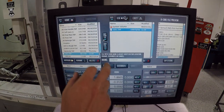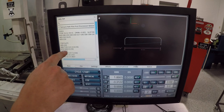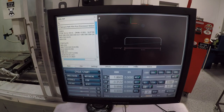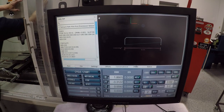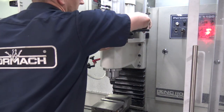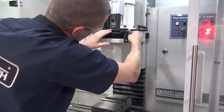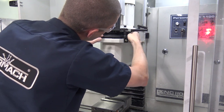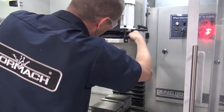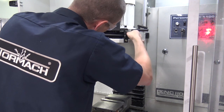Load our program. And first thing I want to do, we're at 400 RPMs, switch it into low, or put the pulley to low. I really never do this with the exception of things like the rare huge twist drill or these slitting saws. The biggest thing you want to make sure is, if you do put it low, that you have it correctly shown in Path Pilot.